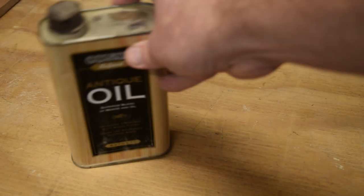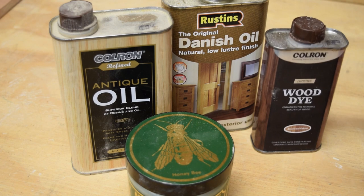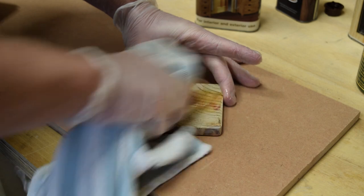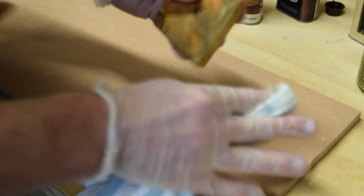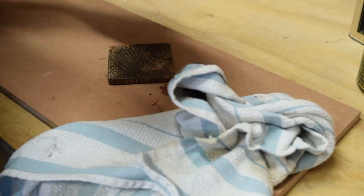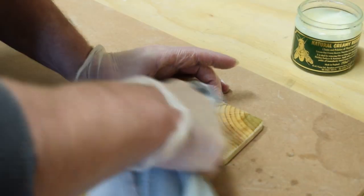The coasters are all cut, rough sanded, and smooth sanded, so now it's time to move on to finishing. I've got a couple of different oils - antique oil, danish oil, beeswax, and some stain. I'm going to experiment with these on the coasters and give you a look at the different finishes you can get with each. Splashing on the stains and oils in a rough and ready style, whizzing through the application of these oils and stains to show the different finishes. The last one is beeswax, which is one of my favorites to work with.